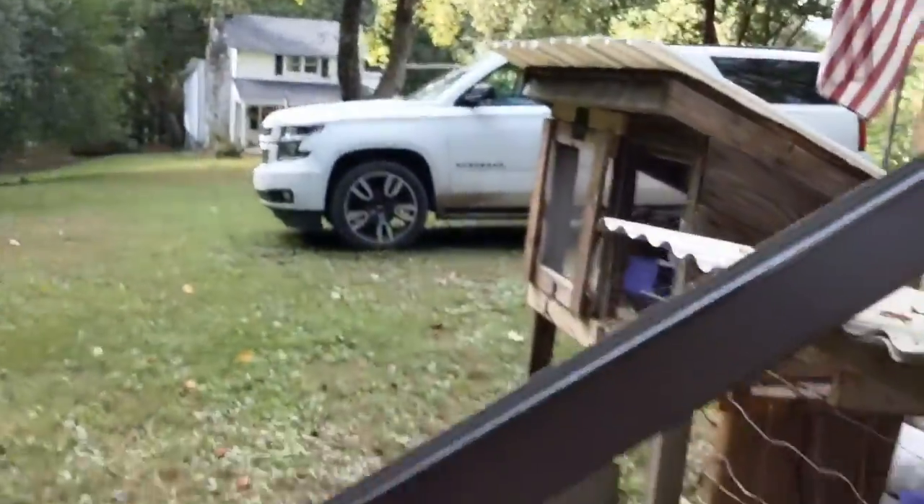So the first thing that we're going to do is, when you're attaching your gutters and everything, is deciding how long you need them to be. They're not expensive — I think it's only $10 for that 10-foot piece. I've just got the one piece that I'm going to attach here on the side of this work shed. And instead of redoing a lot of stuff — lumber is really expensive right now — I'm going to use these pressure treated one-by-ones and just attach them on the side. Then I'm just going to screw in the gutters to the one-bys so that we have something to attach them to. They do make hooks; I didn't pick any up, but I don't think it needs to support a ton of weight because the water, whenever it does collect, is going to be running down into the downspout.